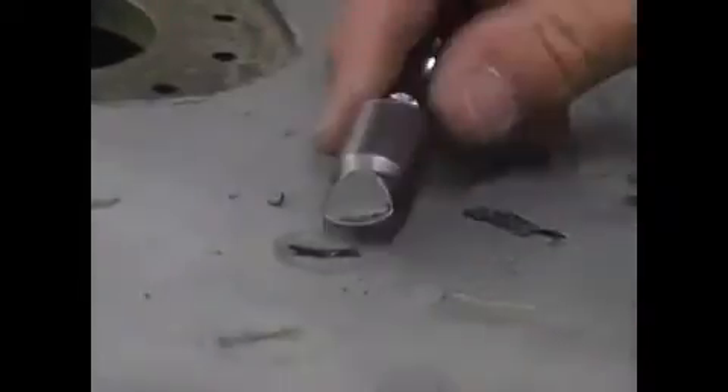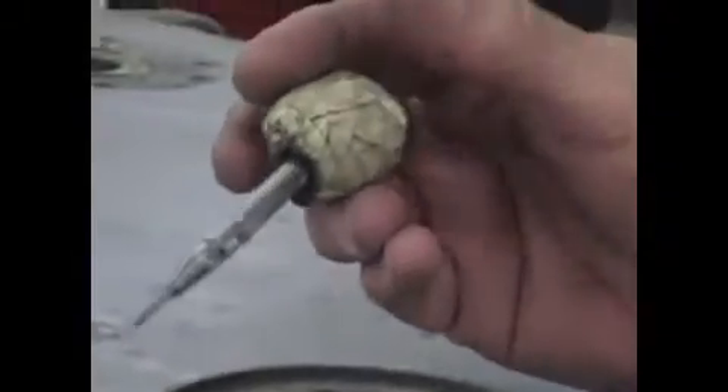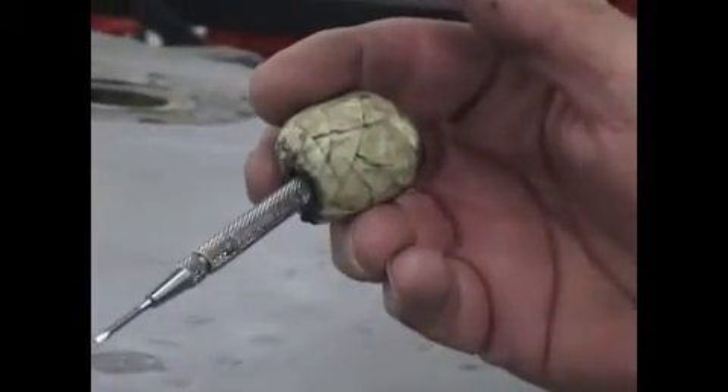Each one of these screw heads has a sealant. We've had a small hydraulic tubing filed off to a point, trying to gouge in there. Some people use regular flat-tip screwdrivers. We've tried awls, just anything with an edge that looks like it'll fit in the groove. But this right here is about the best — it's lasted through all the wings we've done, probably 15 to 18 wings.